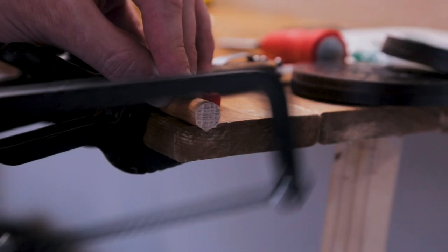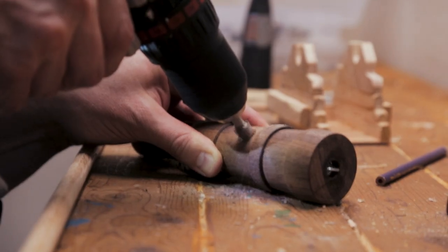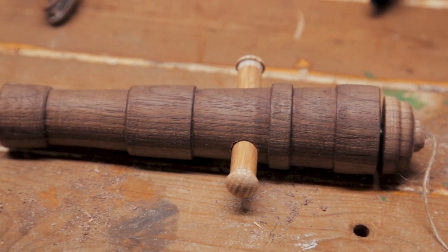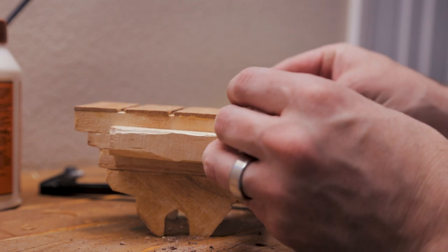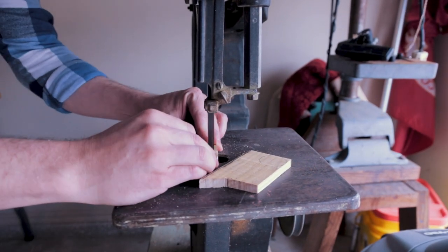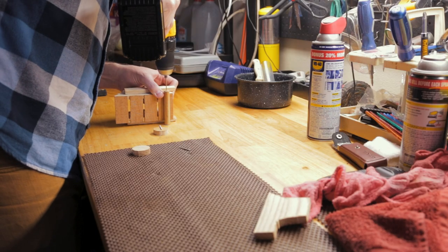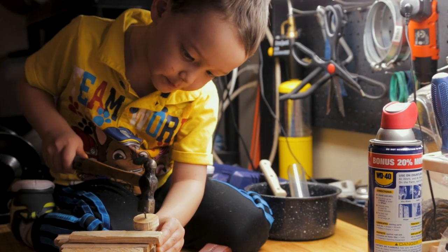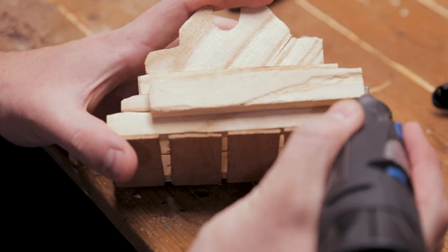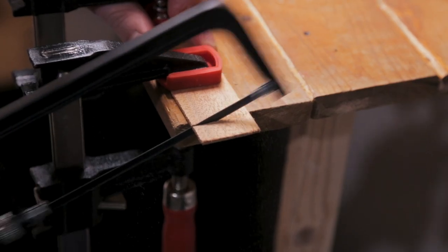I cut two pieces of a dowel and glued some wood caps on one side, then drilled a hole into each side of the cannon and glued the dowel pieces into the holes. I cut another piece of dowel to fit on the base for the wheels, and then cut two wheels out of scrap oak. I drilled holes into the dowel and got some help hammering the wheels in. I took my Dremel to distress the pieces further and started adding pieces of cherry for the decorative metal pieces of the base.